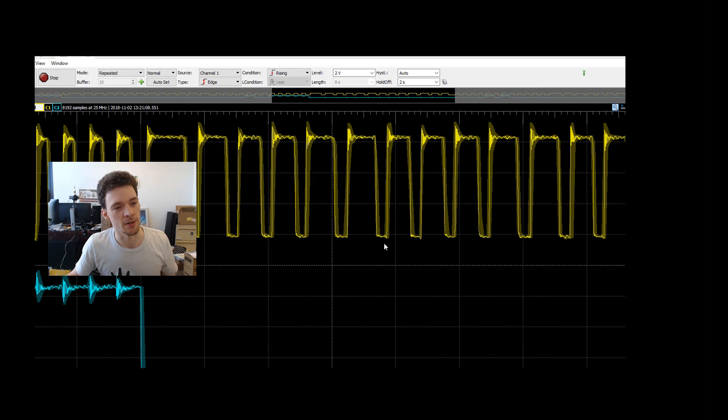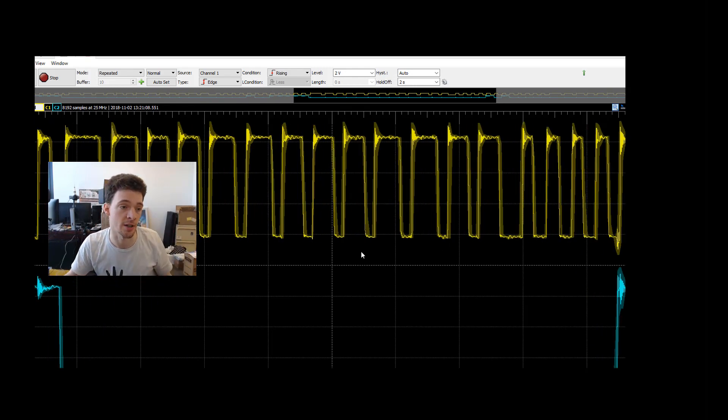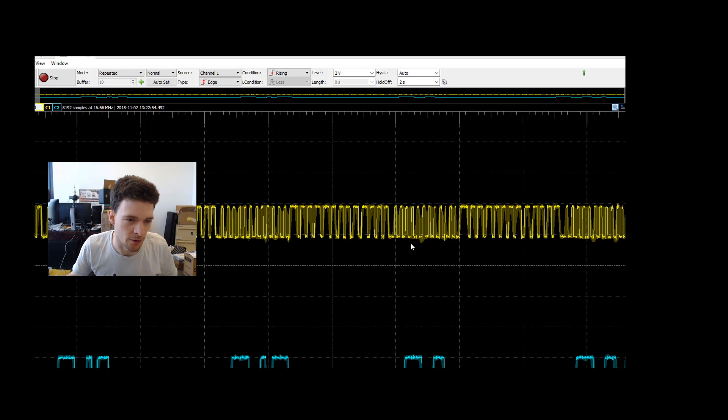There's something to notice: there is this section with a slower clock rate. I've tried to figure it out and have no idea — I can't get it to do anything in that section. Over here it's still pulsing in the high frequency section, no different than before. I think this could be the clock pulses required to actually process the command by the PMS-150C. It could take 12 clock pulses to process a word — perhaps those pulses are required to shift data out of one register into another. I suspect those slow-frequency pulses are lower frequency because that's how much time the device needs to process things.